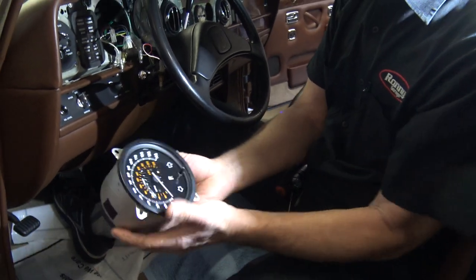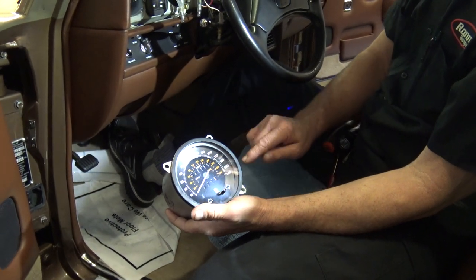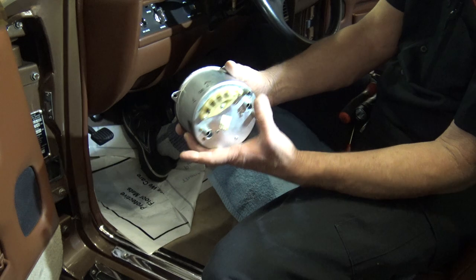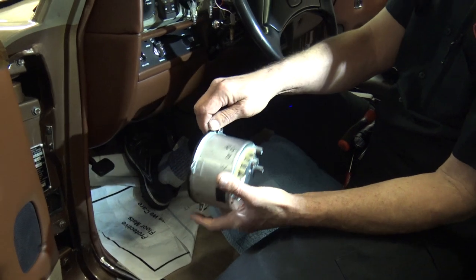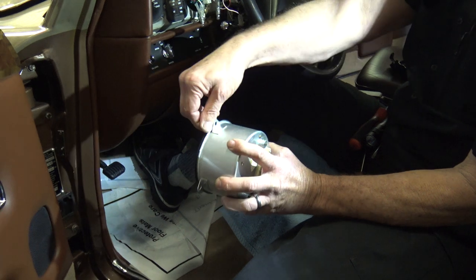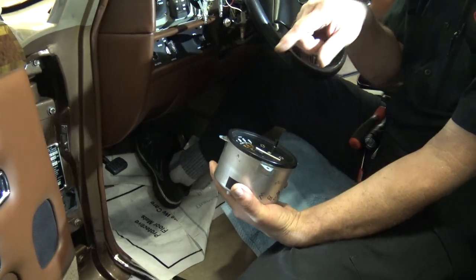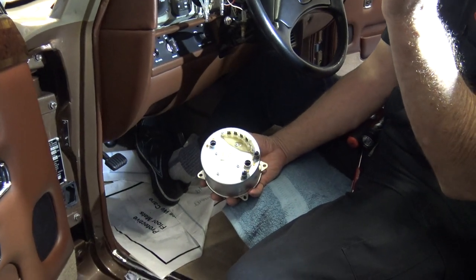So the reason I don't recommend that anybody try to replace the gear themselves is, first of all, if you scratch anything in here it's going to be permanent, and it's expensive to get this fixed. But also, to get inside to change it you have to take the face off. As you can see, this face has been folded over. When they've never been apart, it's nice and smooth and painted. You've got to gently pry that all the way around to pull it off, then pull this face off without touching and damaging it, then get that little electric motor out, change the gear, and put it together and hope it works.